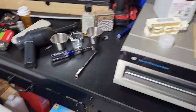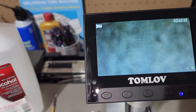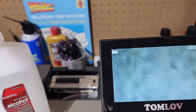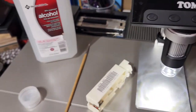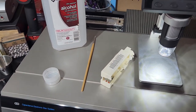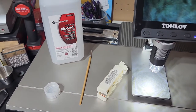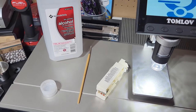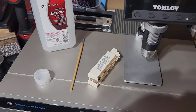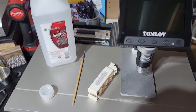So I'm going to continue to try to get that debris off. Sometimes it's stuck on there pretty good — it takes a few strokes, and sometimes you've got to let it soak for a little while and then come back to it again. That's how you clean a stylus on a RCA CED player — well, there's other brands besides RCA, like Hitachi. It works on all the styluses they made for CED players. And the battery died. Thanks for watching my video.